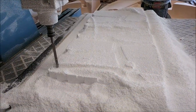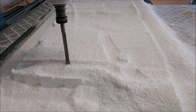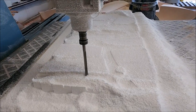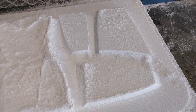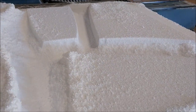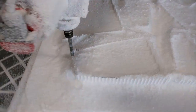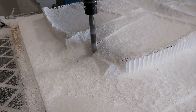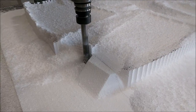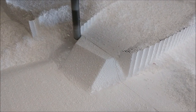Here's the first set of ribs up on the mill — roughing cut around the flange already done, cutting in between some of them, and doing the face cut on top. A little further along, the ball mill goes around the edges to give a nice radius on both the top and the bottom transition to the flat flange. That one only took a couple of hours to finish, and we'll be doing quite a few of those when we do the ribs for the main wings as well. That's our update for this week — thanks for watching.